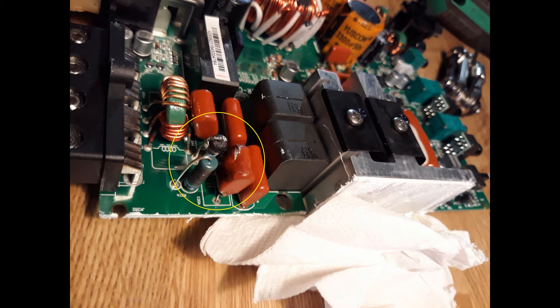The fix this video describes is the replacement of what I call the output resistors and capacitors. These components reside on the board just before the speaker output terminals. Symptoms may include the amp shutting itself down and feeling hot to the touch, intermittent cutting out while going over bumps, possibly no output, or smoke.